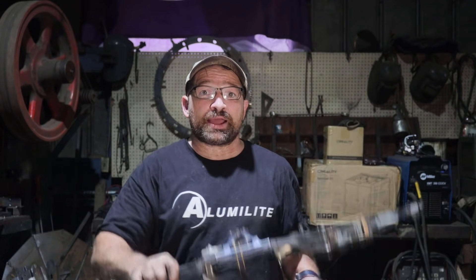I'm going to start out by laying out the bracket in cardboard. Then, once I have something I like, I'll transfer it over to grid paper, then AutoCAD, so I can cut it out on the plasma cutter. Then form it up in the press brake and maybe weld on a couple of gussets. Let's get started with a Sharpie and a piece of cardboard and see where it goes from there.